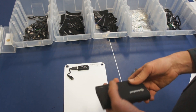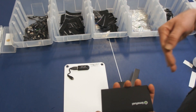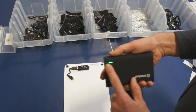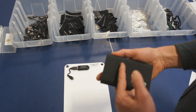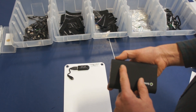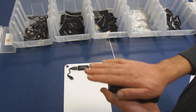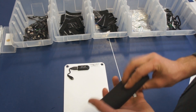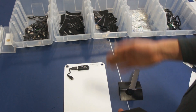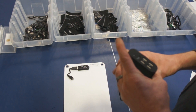I've been experimenting with full discharge — running two LED lights for seven-plus hours and then recharging. It took just over 11 hours in winter sun with broken clouds. I charge it over the span of a day, then the sun sets early over the back of a hill here, so I did a partial charge one day and brought it back up to four bars the next morning. When all four LEDs light, it is fully charged. I've noticed that when charging on the power cord overnight, the four lights will completely stop blinking when done. As summer gets here, I can run this through its paces and publish actual charge and discharge times at teslamaker.com. For everybody that's bought one, feel free to share your charge times with me — I'd love to get that data.